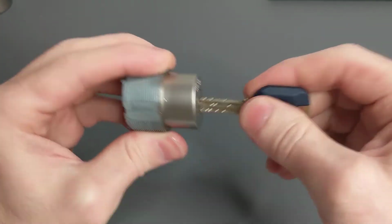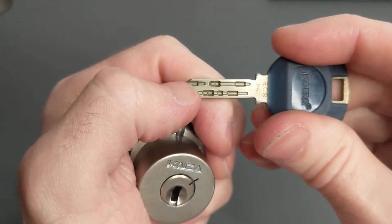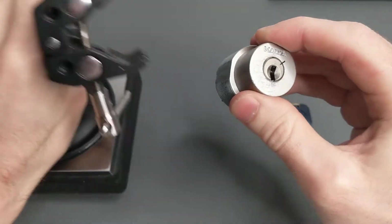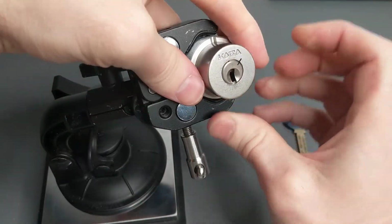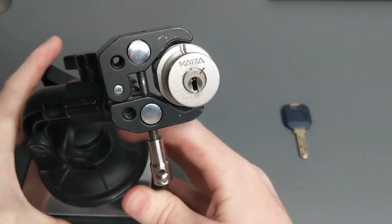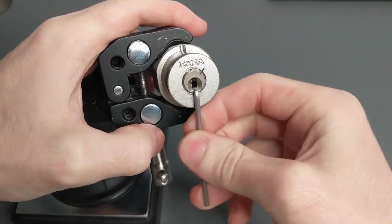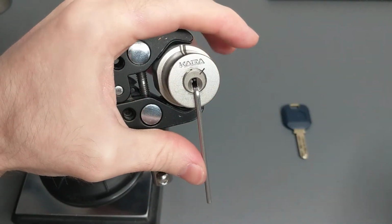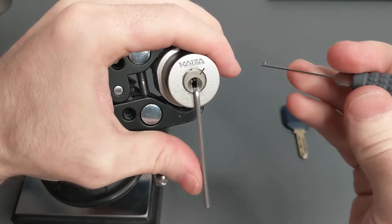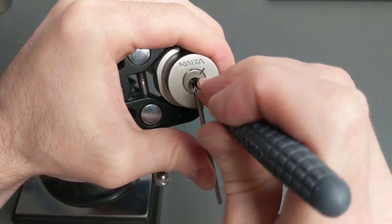And it uses the normal Kaba key milling to make it hard to tell where key pins are, except on the edge. So, like other Kaba locks, these are built to quite good tolerances. That can make them a little tricky to get open. Using a snug-fitting tensioner, not because I need a lot of back-and-forth control, but because I need to put a lot of force into this to get everything to stay set. I'll be going counterclockwise, and I'll start on the right.